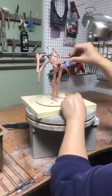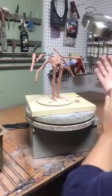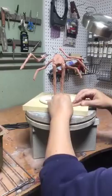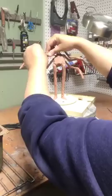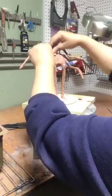Also, with Chavant, for molding, you have the opportunity to use platinum-based silicones because there's no sulfur in it. Platinum silicones hate sulfur. So if you try to make a platinum mold of a latex mask, which has a lot of sulfur in it, or a Roma Plastilina sculpture, the material would never set up, because it just rejects sulfur.